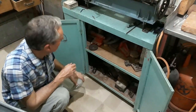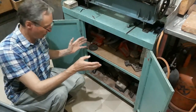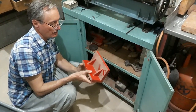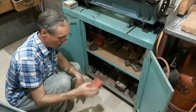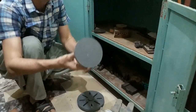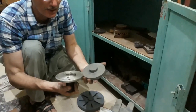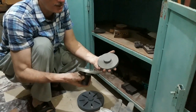Underneath the stand is a handy cupboard and I've got all sorts of bits and pieces in here which basically have to do with the construction of this. One of the first things I made was this angle plate — this is the pattern for that. I also made a scribing block which I used for marking out. These were all necessary in preparation for making the lathe itself. This is an important casting — before I had a face plate or a chuck, this was how I mounted my work, and it was made out of aluminium because in the early stages machining was a challenge when the lathe wasn't set up properly.